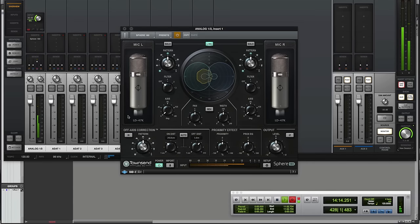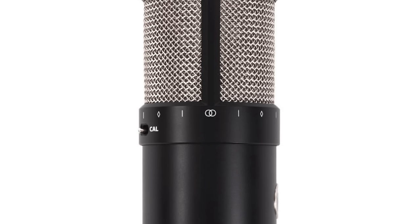Now, at the moment, I'm still talking into the front of the microphone, and you can tell I'm coming out heavily out of one side. That is because I now need to twist the microphone so that this symbol is pointing towards the thing that you are recording, in this case, my voice. So, 1 second.